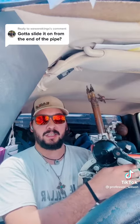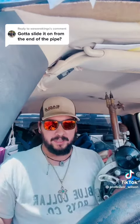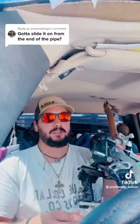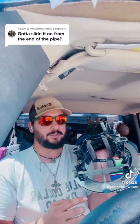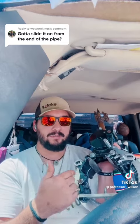You just loosen these right here, adjust it to the size pipe you want, and there you go. It is the simplest beveler I've ever owned, simplest thing I've ever used, and it is smooth. What helps make it smooth is you don't have that opening on the bottom where you have to jump the gear every single time you come around.